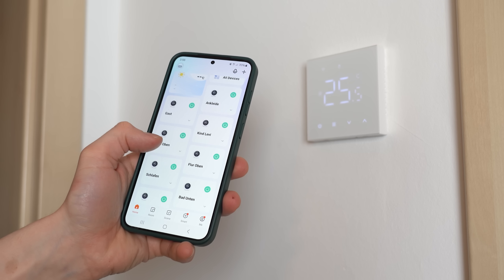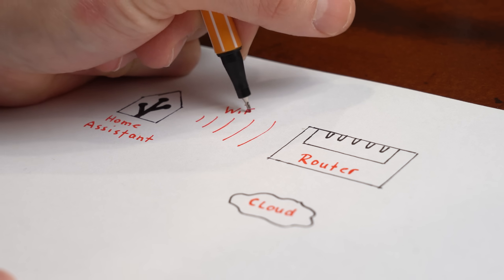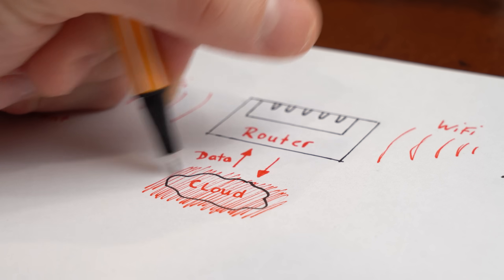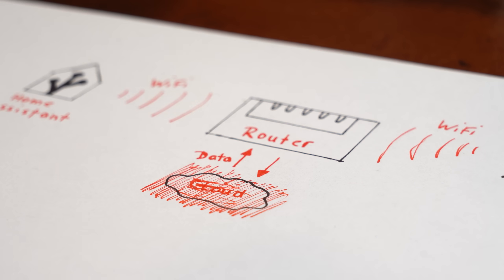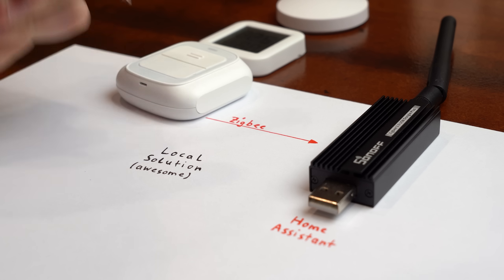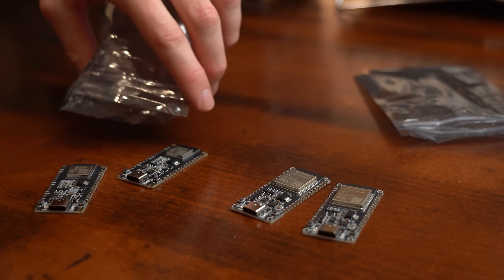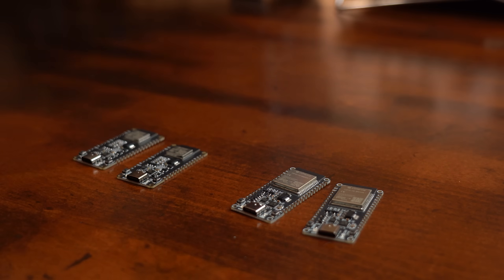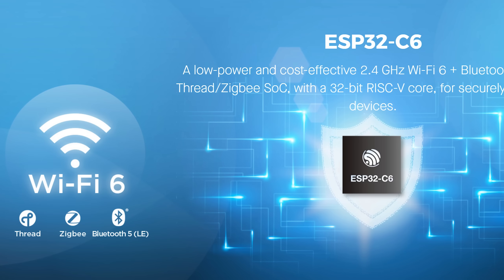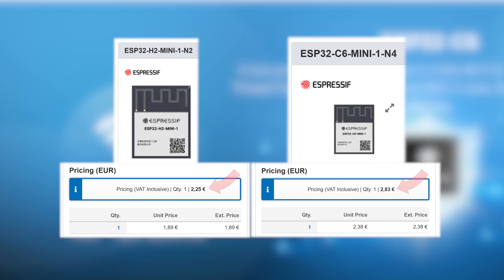In comparison, my WiFi thermostats send and get their data from the manufacturer's cloud, which my Home Assistant system then uses to communicate. That means this system is not managed locally, and if one day a manufacturer goes bankrupt and ends its cloud service, your WiFi devices basically become a paperweight. This is a clear advantage of Zigbee, at least when it comes to home automation. Moving on, let's have a closer look at the two ESP32 models that support Zigbee. The H2 is a bit more lightweight because it can mainly do Bluetooth and Zigbee, while the C6 also supports WiFi 6. But researching online it seems like both come at a similar price point.